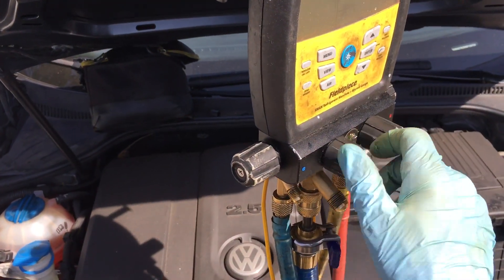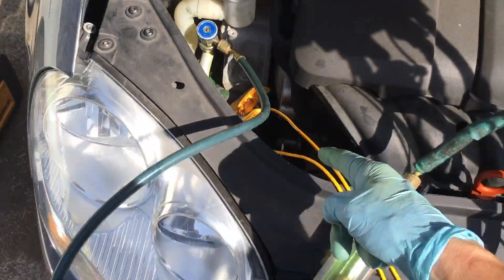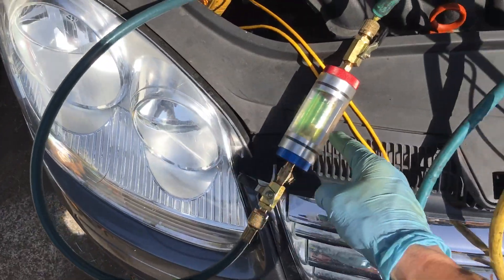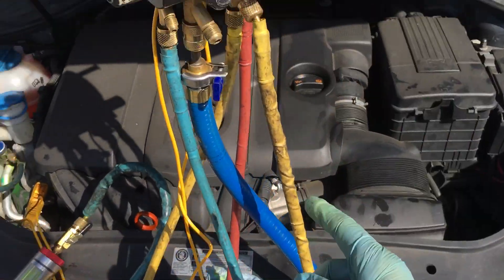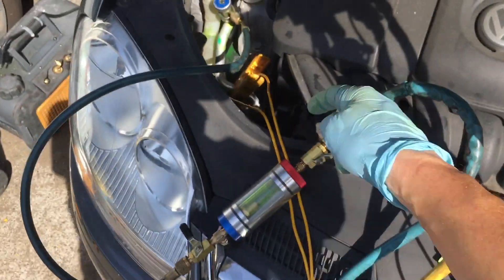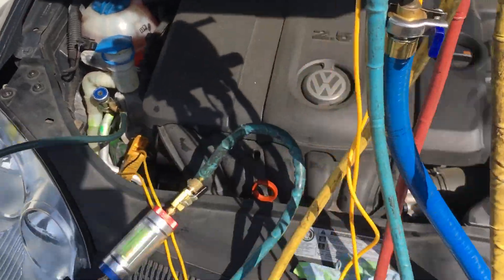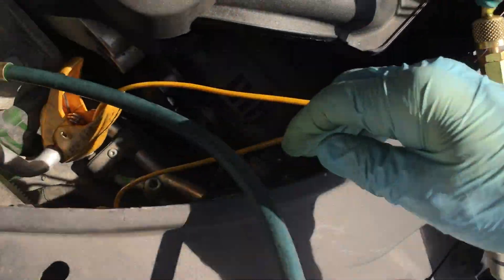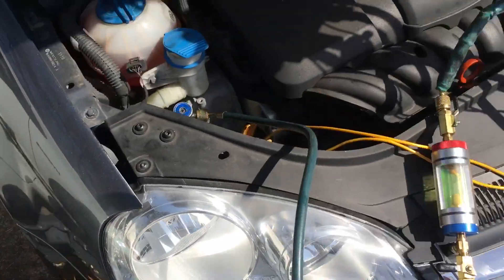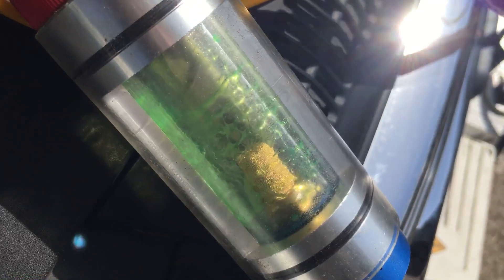So let's turn off the vacuum source. It's closed at the low side. We will fill this up with the liquid refrigerant and we'll do that off the high side. I have the vacuum source off, the low side open, connected to the high side. Now I have the high side valve and I'm going to screw it in.